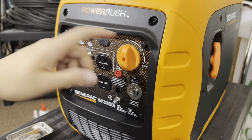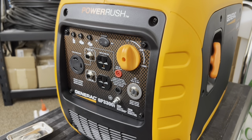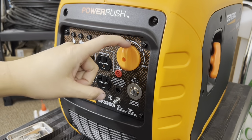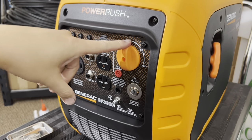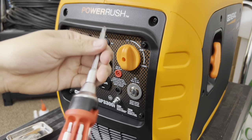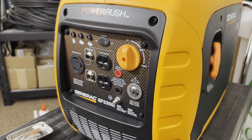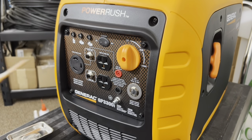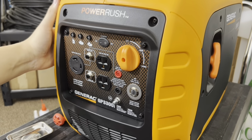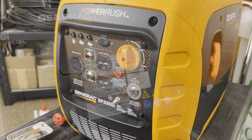Don't crank on it. Behind this switch is a mechanical fuel cutoff valve. That valve is made out of aluminum, and this switch directly screws into that valve. If you go in and just crank on it and just tighten it up, you'll strip the threads right on it. It's soft material, so don't overdo it. Just be gentle with it. Okay. Now we're gonna go ahead and install the cover, and I'll show you how to do that.